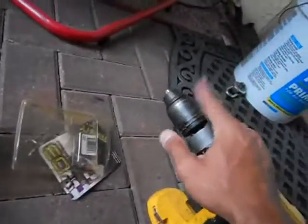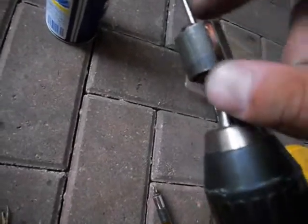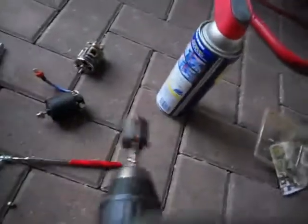Chuck it in there. Make sure you have a good drill chuck too — this one is a little bit wobbly, this one is more true. Make sure you put the commutator side close to the drill; if you put it out here it's going to wobble and be all elliptic, it's not going to be as accurate.